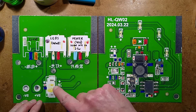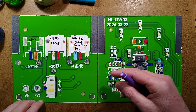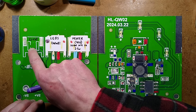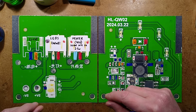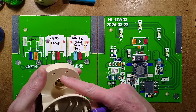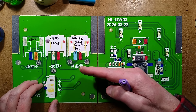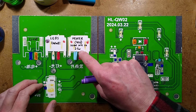On one side of the circuit board are just connectors. We've got the power connector from the USB - it's worth mentioning the USB-C does not have the programming resistors, which means smart chargers won't try to power it at all. We've got one connector for the unused lithium cell - effectively two in parallel. The LEDs draw 240 milliamps, which is much more than I was expecting for that little LED circuit board. That is really pushing those LEDs quite hard. The heater itself has an initial resistance of about 10 ohms but with a slight NTC effect - resistance drops as it heats up - ending up on a 5V supply at about 2.5 watts.